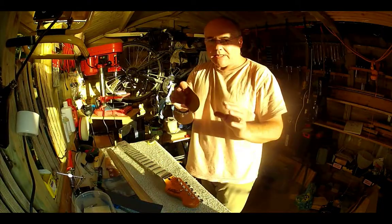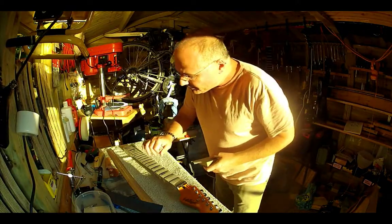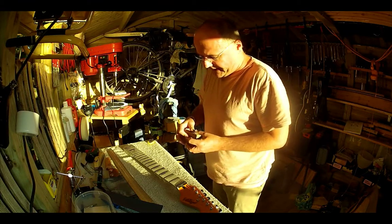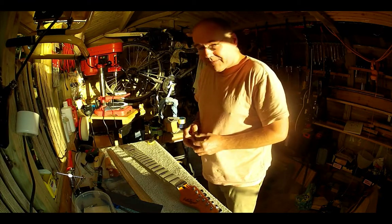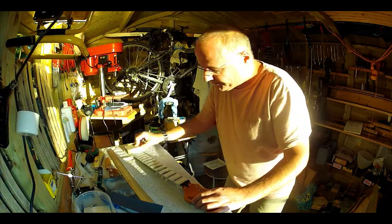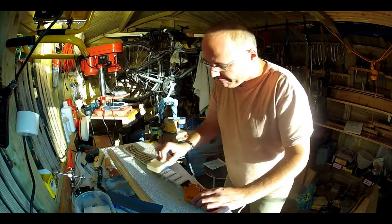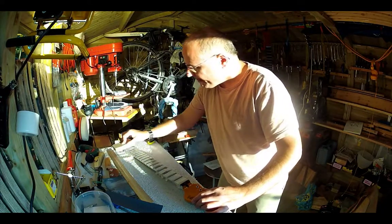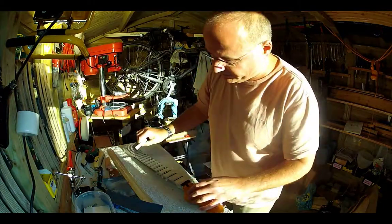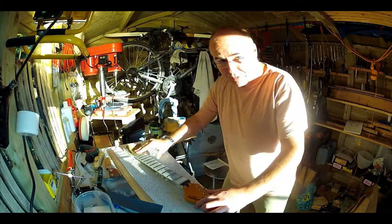So the thing here, starting with our 320, is that we want to get any gouges out of the top of the fret where the black marker pen still is. We want to get that out, but without taking the height of the fret down too much. Or if we do have to take the fret down, we take all of them down together, so we make sure that everything gets approximately the same treatment up and down the neck, so that it's a uniform coverage. Going to do it by hand then. Let them ride over the fret and up and down the side of them to keep them round, so we don't just recreate a flat spot.